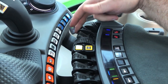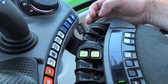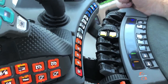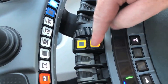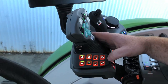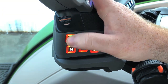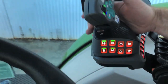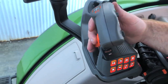Here's your linkage — you've got a lock here, your locks are here, up and down on your rear linkage. You've also got your remote and your depth there, and then the front ones here as well. It's like your comfort control, like we had in the previous models. PTO — you're keeping to the same colour coordination like they used to. There's a yellow. Your rear one — this one doesn't have front PTO but it's got a version there for it. Your engine rev speeds are here, your cruise speeds are here, your one and two ranges for your transmission here, your foot pedal mode, your TMS, and your neutralise button. Your response is behind here now. And that's your normal trigger lever — same remote as your old joystick.